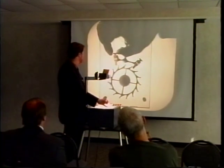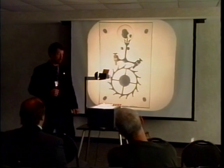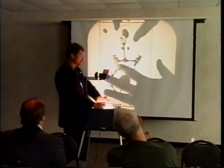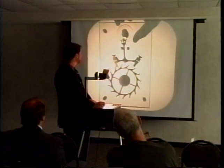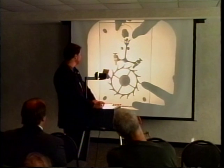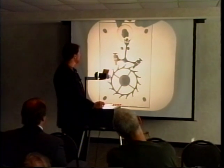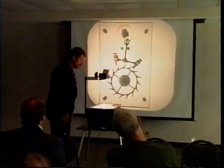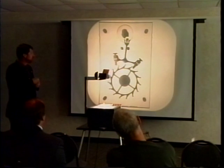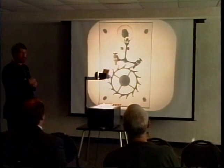I like to try and get people to understand what it is that's going on with the escapement when we do that. If we have our stone set for lock, at the moment of let off, the pallet stone and the escape wheel tooth, boom, right there, let off at that point, and the roller jewel is exiting the fork slot, this space right here is your corner clearance, okay? We have drop lock here, and you can't really tell, but we're not up against the banking pin, so the slide hasn't happened yet.